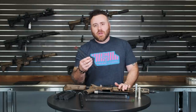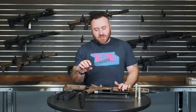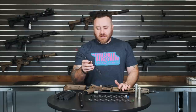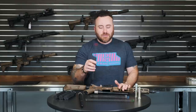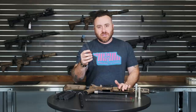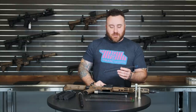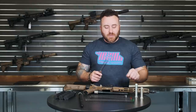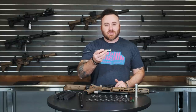Next is the red spring. It's a carbine spring but on the heavier side. We typically use these in 10.5s and for suppressed guns — it has more coils, higher pressure, to slow the BCG down. Then this is the universal one we use for almost all builds: if you're using the standard mil-spec receiver extension, it's the blue spring. It has good tension and we use it in combination with an H1 buffer.